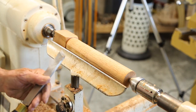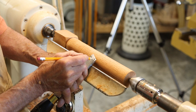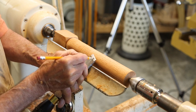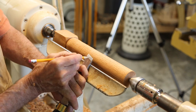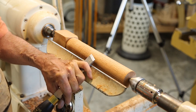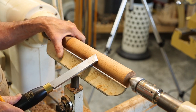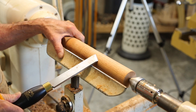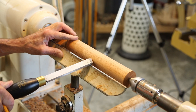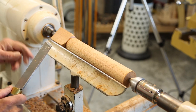Frank Paine in his iconic book of the 1950s, 'The Practical Wood Turner,' said that you only bought all of this chisel but you can only use half of it. In fact you can only use the section from about here to about here, and if you cut with much more of the edge than that you will be overwhelmed and a catch will happen. A catch happens when this comes off the bevel, starts to screw through like that, comes down and the point catches — so we want to avoid that and use about half the cutting edge.